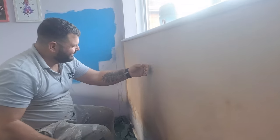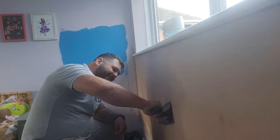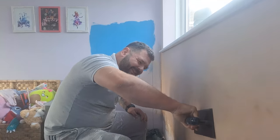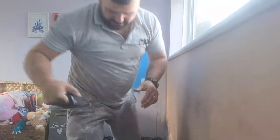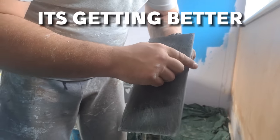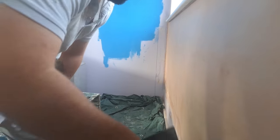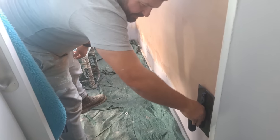I'm giving it the third trowel and it's polishing — I'm not even joking. Look, can you look down the wall? Is it looking smooth? Can you see a shine in it? Look how nice that blade is — can you see how smooth and beautiful? We're going to have to just give this a polish in a minute, clean down and we're done. I can't get my hand in there so I'm having to hold it like that, just for doing these bottom bits.